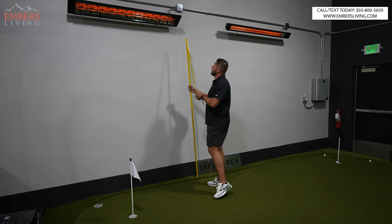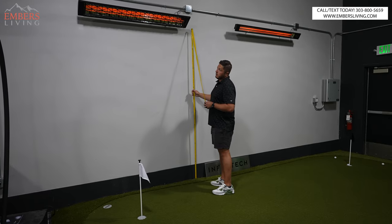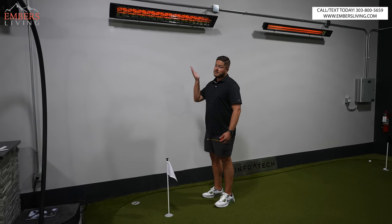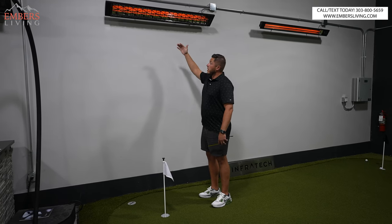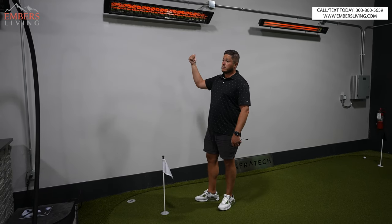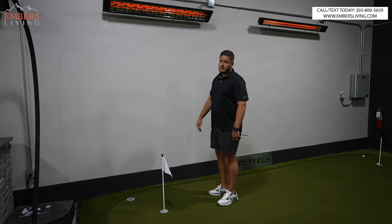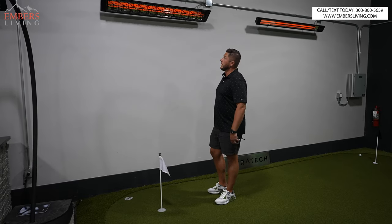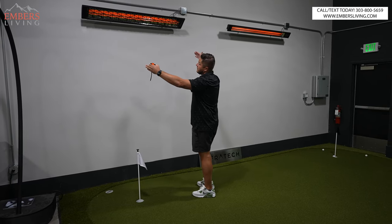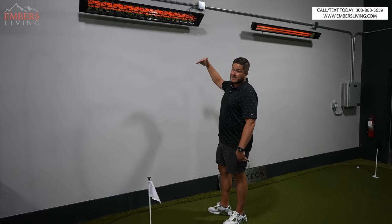They recommend the 6,000 watt model gets mounted higher — between eight and twelve feet. You definitely don't want it lower than eight feet, because it's going to melt your face off — this is really hot when standing under it. The smaller ones can be mounted a little shorter. That's why I always ask: what's your ceiling height? If you have 10 foot ceilings, I'm probably automatically going to put you in the 6,000 watt. The higher up they're mounted, the less powerful they'll feel. A CD-40 or CD-50 is great for the seven to eight foot range, in my opinion.